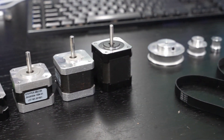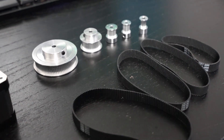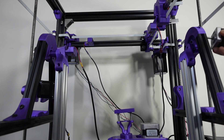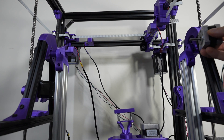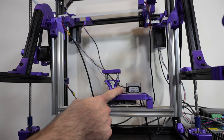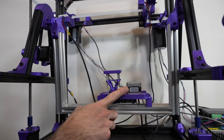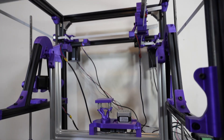For now let's stick with the pulleys approach to experiment with different speeds and torques. Option 3: add another motor in mirror to this one — this idea appeals to my preference for symmetry, but it means extra parts and higher costs, so perhaps I'll consider this as a last resort. Option 4: make the U-gantry lighter and more efficient. This is something I will have to do eventually if I want to achieve a sleek design, so let's put a pin on it for now — Option 4 is going to have to happen at some point anyway.